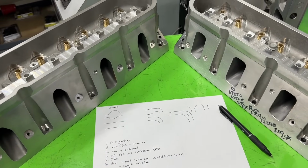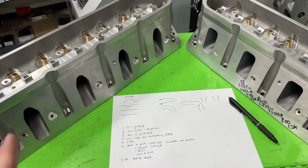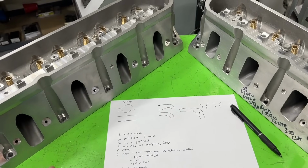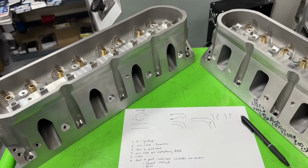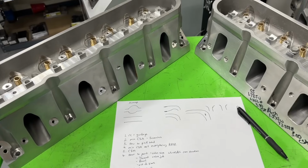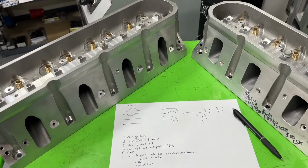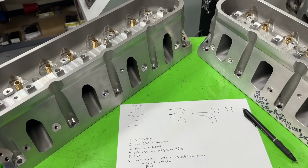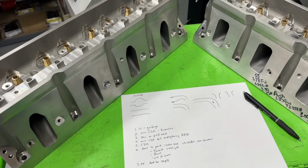So in my experience, with lower RPM stuff, you can get away with a really small CSA. You can even get away with a slightly large CSA. There are several examples, if you watch enough of my channel where I've done dyno stuff, where the larger CSA made more torque down low than it did at the top, and more power at the top. So it's not entirely true. See what I mean? There's more to it.